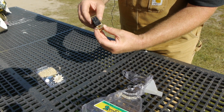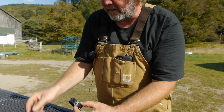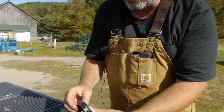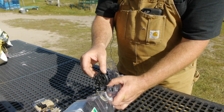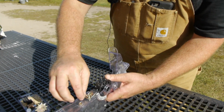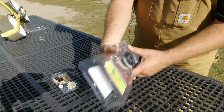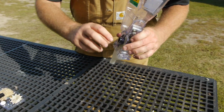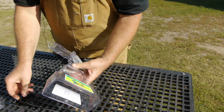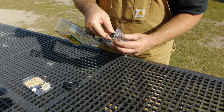But when you don't care so much, and let's say I'm using chard, then I take this out when it's like rough seed or odd size seeds, or I want more than one in a hole. And then it's really just the brushes that are going to work at that point, which is this brush right here, which also has an adjustment as well, up or down. And so you can use it without the felt, right? And then it's just the brush that's going to decide what seed passes through there. And I use that when I'm doing like baby chard. I'll take this felt out.